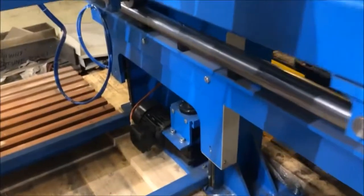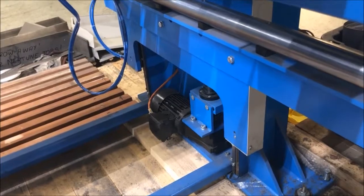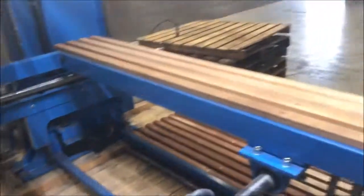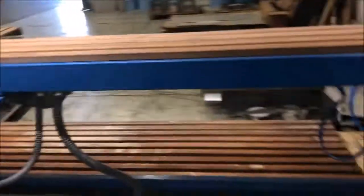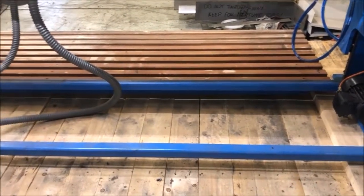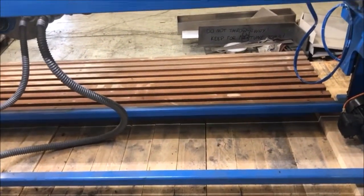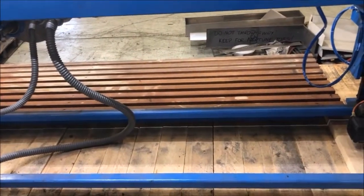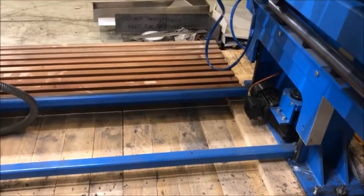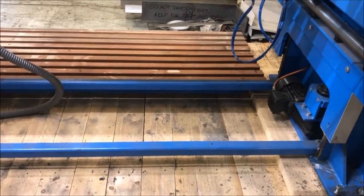On the bottom you have on each side a servo motor for the table up and down. The table auto-levels by bringing it all the way down and hitting the limit switches — that levels the table. These two struts are only there if you still need to transport the machine; this machine is still sitting on its original pallet. It will be taken off and located, then you can take these out and you have full clearance all the way to the floor and can put in your own fixture.